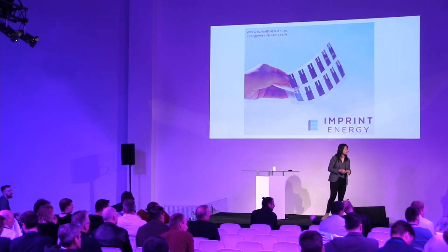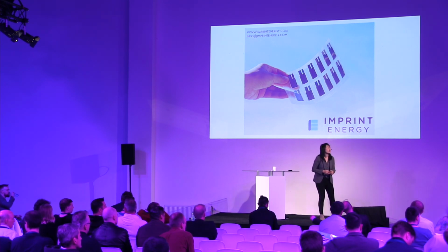Okay, and what's the degradation cycle count? I mean, when it starts to degrade, how many times can you recharge it? Yeah. So it depends on the methodology of recharge, like the rate of charge and what voltage windows. So for deep discharges, we're around 300 cycles or so. But for shallow discharges, which are more common for energy harvesting, we've done many thousands. And so the cumulative capacity, for example, for this battery can be on the order of hundreds to even thousands of milliamp hours with that type of charging. That's amazing. Thank you.